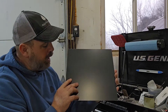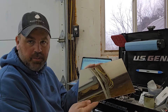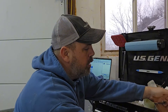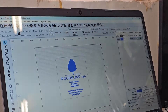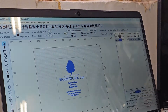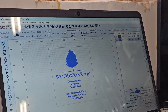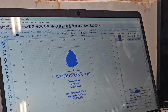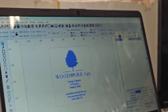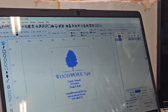Of course the backside has a coating on it — that's what I'm actually going to be etching, not the shiny side. So what we're going to do is come into LightBurn. I've got my company logo set up in here, that's what we're going to run today just to see how it works. And since it's going to be going on the backside, the coated side of the glass, we're going to want to reverse this image because it's going to be printing on the back.